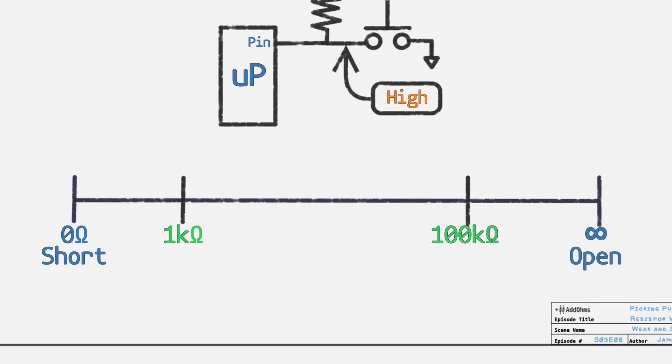Here's why I keep sticking to ranges. A large resistance value is called a weak pull-up, and small values are called strong pull-ups. The lower resistance values allow more current to flow, making the pull to the supply stronger. Your design determines the exact value. A weak pull-up that is too big starts to look like an open, making the pin float. The downside to a strong pull-up is that when the button is pressed, the resistor burns more power — wasted energy. If you're using a battery, you might want to use larger resistors.